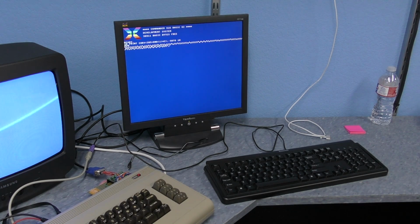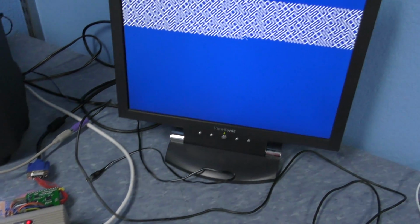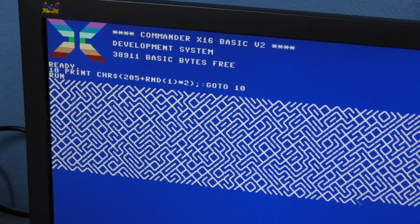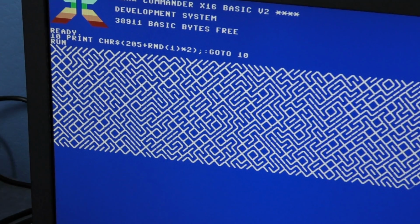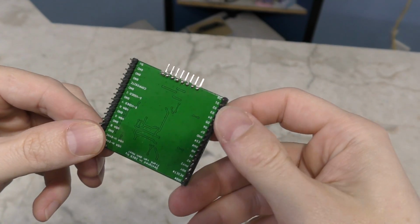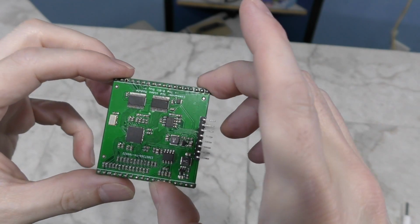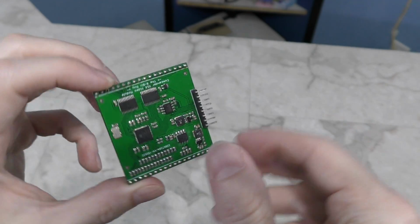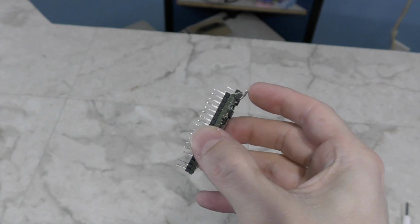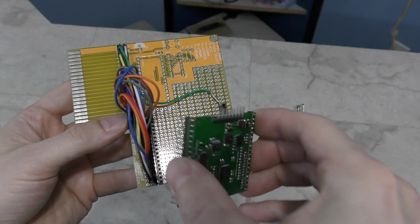It was really important to be able to see the chip working on a C64, not only so that we could prove that the FPGA design worked and was compatible with a 6502 processor, but also so we could start developing kernel code that would eventually make its way into the final production board. In fact, we've talked about making this into a separate product for the C64 users once all the FPGA design is complete, which would give all of the Commander X16's video features to C64 users, or heck, even VIC-20 and PET users for that matter.